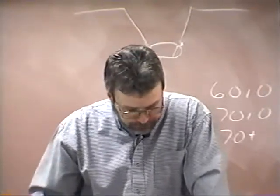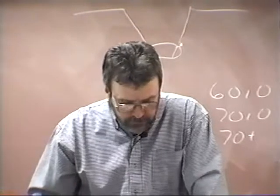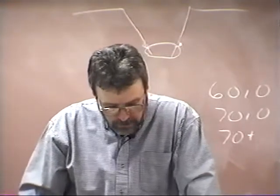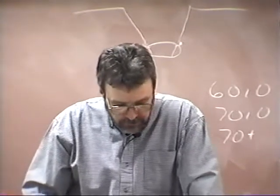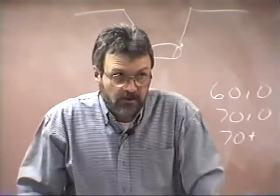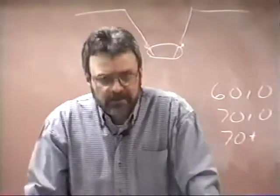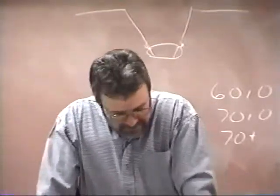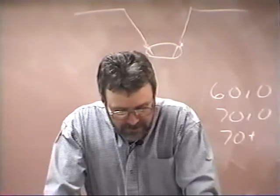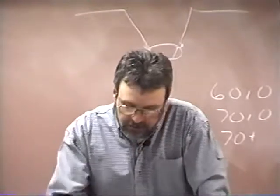Page 122, last paragraph before we get into the cover pass, it says the joint must be evenly filled with weld metal before the cover pass is made. Therefore, additional beads called strippers, in my experience we've called them pisser passes, but strippers sounds a little more politically correct, so stripper beads will frequently have to be deposited on the sides of the joint as shown in figure 828. Yeah, you can see along the sides here.